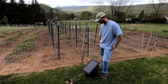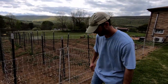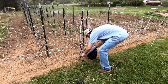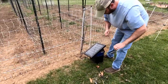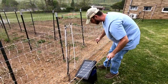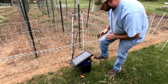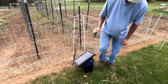This is our energizer here, and this is powerful enough to handle — I believe — 10 of these long fences, but we have two. I like to put it out of the way, and you need to face it to the sun, obviously — it's solar. So this is the perfect spot. We have the negative side, and the negative in this case is the ground — the actual ground. Depending on what version you have of this energizer, you may have a stake or something that looks a little different.